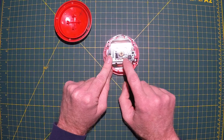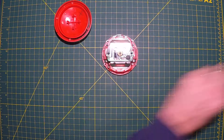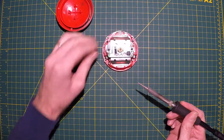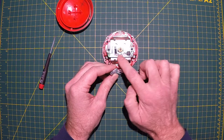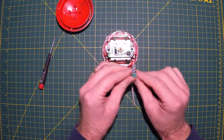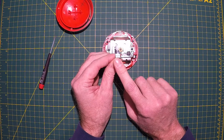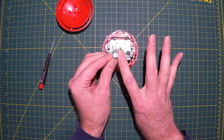So this is the pitch resistor right here. I'm going to go ahead and remove that. Now I'm going to be adding a potentiometer connected to those two points. This potentiometer is marked 504 or B504, so it's a linear 504 — the four, you think of four zeros — so this is a 500k.